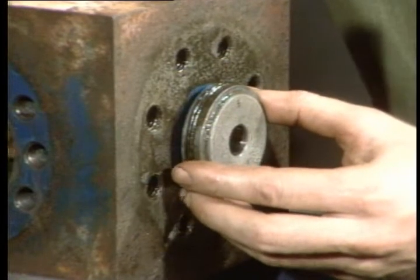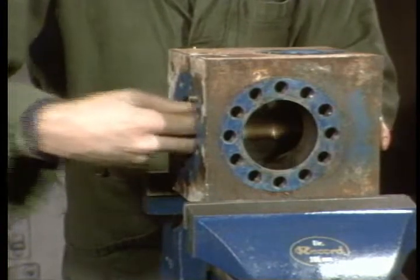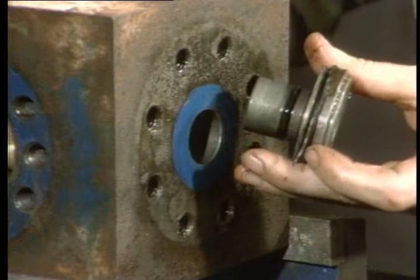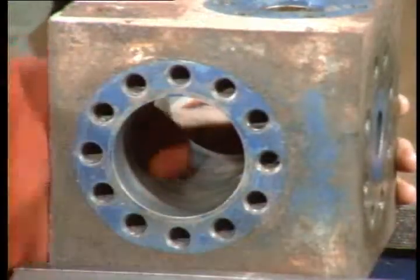out the plunger guide. If you ever have difficulty pulling a valve part by hand, use a brass or wooden rod and nothing else to get it out. After using the rod, make certain any brass or wood chips have been cleaned away before you reassemble the valve.